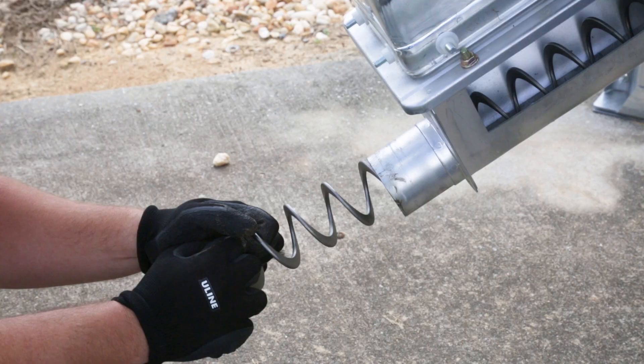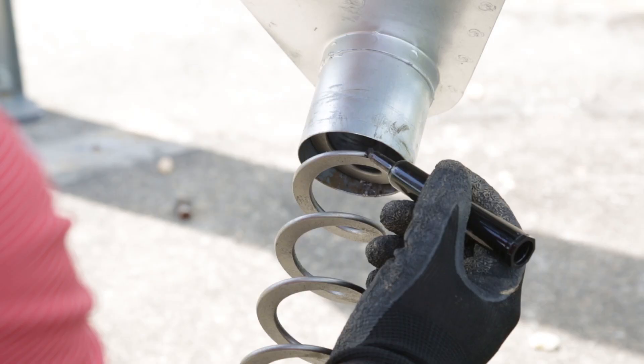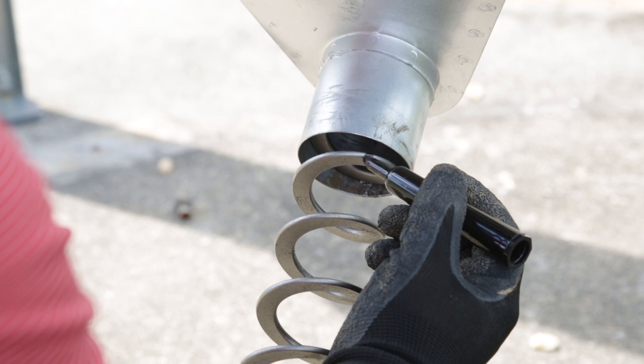Return to the unloader and cut the auger line approximately 6 inches from the box. Pull on the auger line a few times until it begins to stretch and slowly release it. This will relax the auger to its natural length.